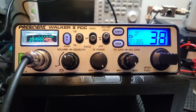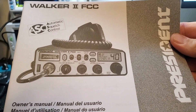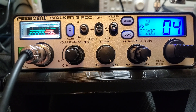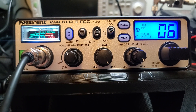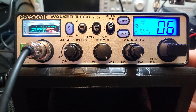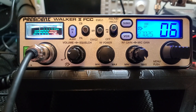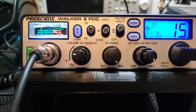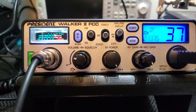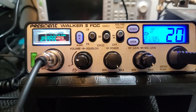It's a nice feature that you don't really know it has because it doesn't say it on the front of the radio anywhere — it's in the manual. That's why I always tell customers: when you buy one of these President radios they make really nice manuals, go ahead and look through them, there are certain features you may not know the radio even has. The radio has RF power adjustment from the factory — I believe it was like a watt and a half all the way down, and then I adjusted this one to four watts because out of the box it was like 3.5. I also adjusted the modulation level up just a little bit; out of the box it's a little low, which is normal. It's a pretty simple thing to do — you don't even have to open the cover, it's all through the front menu. Just use your oscilloscope, put a tone in, and simply adjust it up.